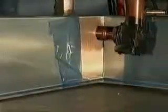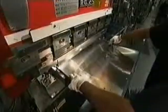A spot welding machine joins two corners of the hood's housing — mainly for aesthetics, as a weld looks better than a screw or bolt. An 80-ton press then bends the hood's shell, making one of eight folds that give the component its final shape.